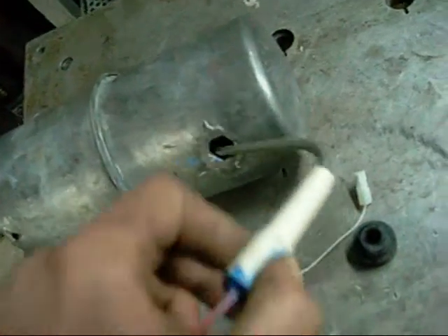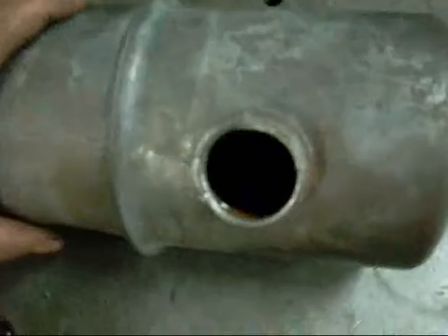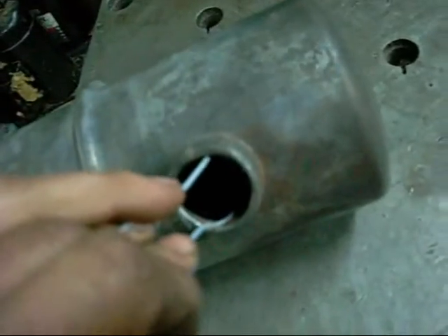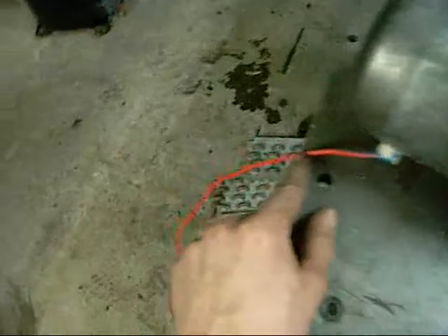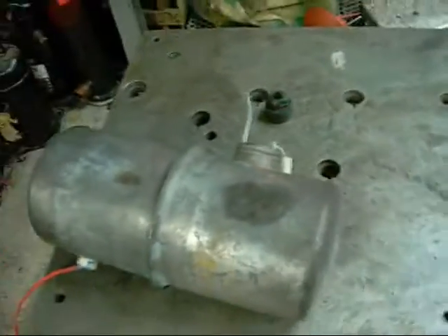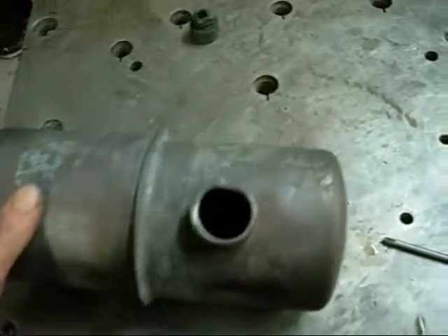That will simply be inserted like so. The tank will be sitting vertical inside that electrolysis system. To stop it from collapsing inside and hitting the side of the tank, I'm going to use this piece of scrap copper wire as a sling — feed it over, pull it up tight, and wedge this bush in the opening. So that sacrificial anode is suspended right in the centre of the tank and it cannot collapse or sit down on the tank itself and short out, because this tank will be the negative pole of the power supply and this wire will be the positive. If that sacrificial anode were to collapse and short out against this, it will short the power supply and shut it down — it won't damage the power supply but it will still shut it down before the process is complete.